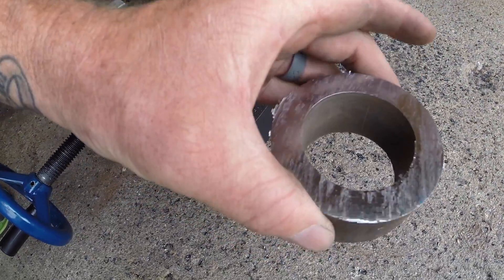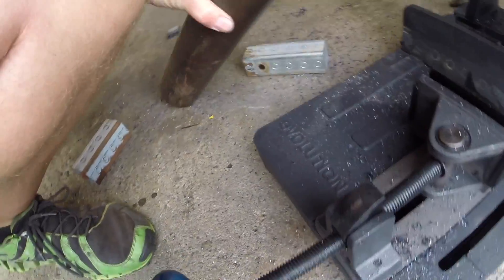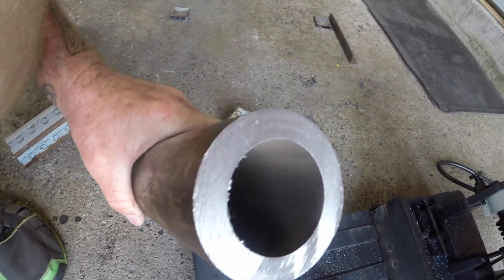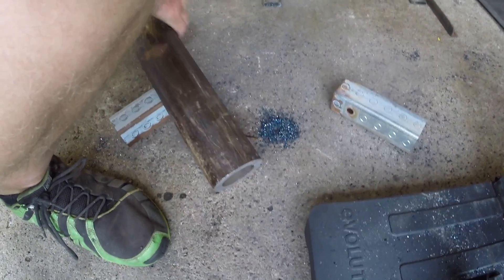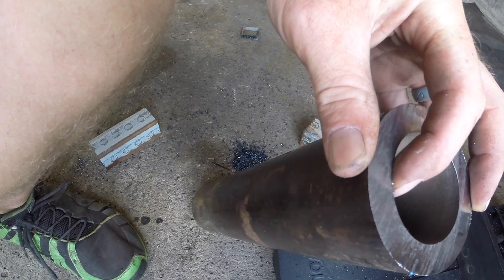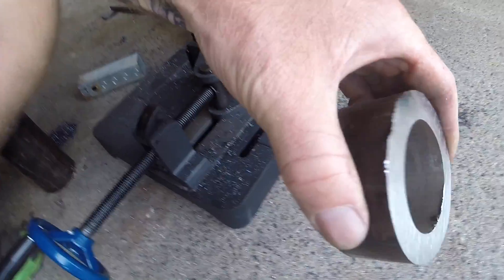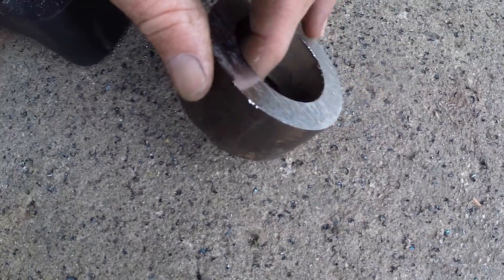This side is the piece I cut off. That's that side, and that's that side. You can see the cold saw side is actually cleaner than the bandsaw side — just a few burrs in here from the bandsaw. The cold saw burr is so minimal I just flicked it off with my finger. On the scrap piece that I cut off, once it got down towards the end it did leave just a little bit of burr, but to me that's pretty impressive.